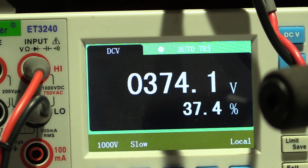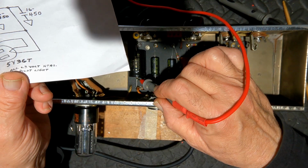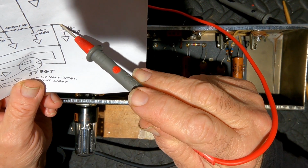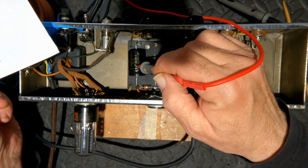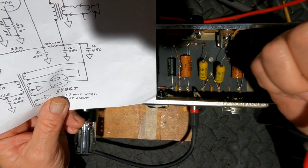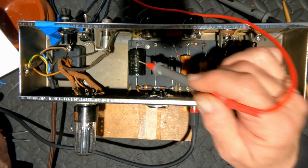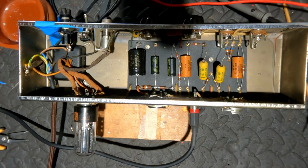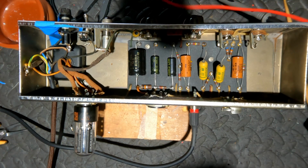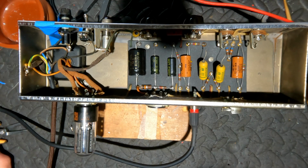So what can we do? We can just leave it and be aware of it. I'm very much inclined to put in a little resistor across that capacitor, this one here, of, I think Fender used like 220k. So I think I might put in a 220k resistor there to just help that capacitor discharge a little bit more, or even bigger, I don't care. 330k doesn't worry me. I would like to tuck it underneath there so it's out of sight for originality's sake.